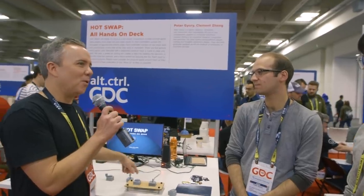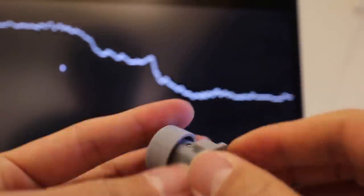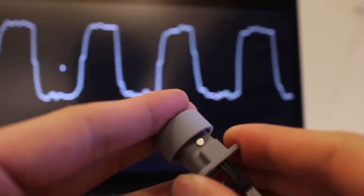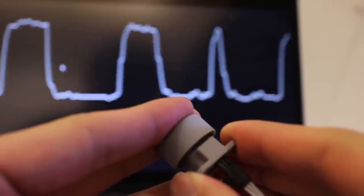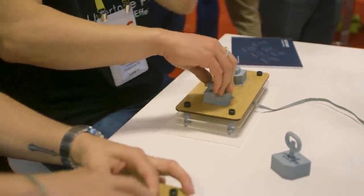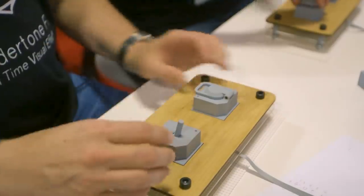When I'm looking at these, I'm thinking there's going to be a potentiometer or a simple tactile switch, but when you open them up, they're all little magnets embedded in the 3D print, and then a hall effect sensor reads the position of where that magnet is. We have a taxonomy — we identified 25 different kinds of inputs you can build with this technique. Hot Swap was built on top of that taxonomy, mixing and matching these different inputs. You can even create inputs that don't exist yet — the hatch, for instance, is an input no one has ever seen before. With this technique, we could make such novel inputs.